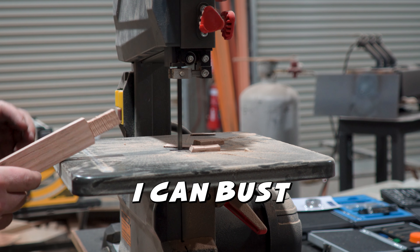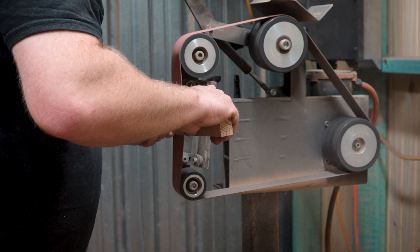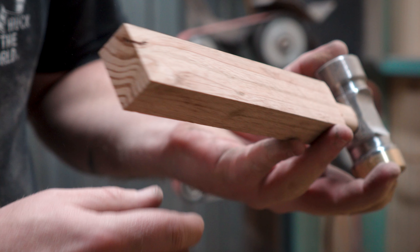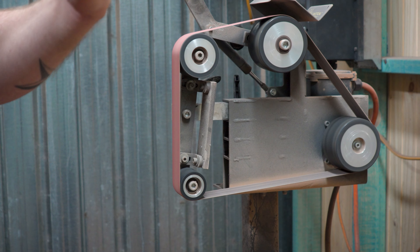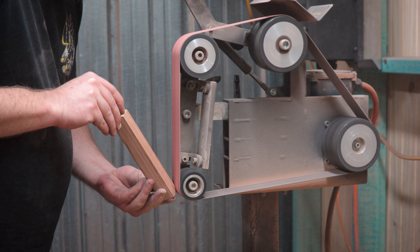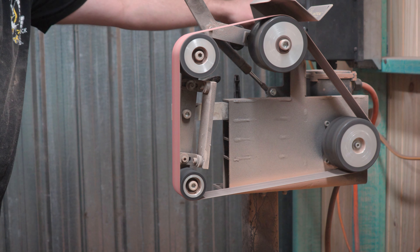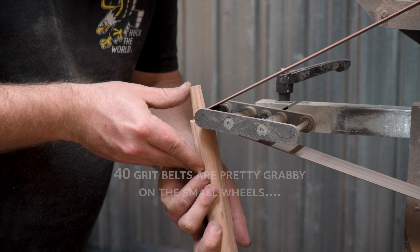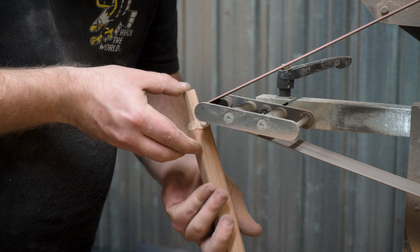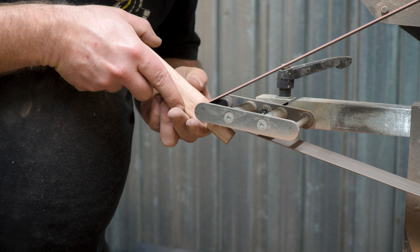That's looking roughed in. So I can bust out the draw knife to give this one some shape. I'll break the corners and bring down the wood until it starts to want to fit through the head, but I want this to be pretty snug — so I don't want it to push all the way through by hand. Then using the slack belt and wheels on the grinder, I'll round everything out until it feels nice in the hand. For the handle-to-head transition, I'm just going to run around the sharp edge from where we fitted the eye. This should give a bit more of a classic look, but also get rid of any sharp stress risers that might be inclined to crack the handle.